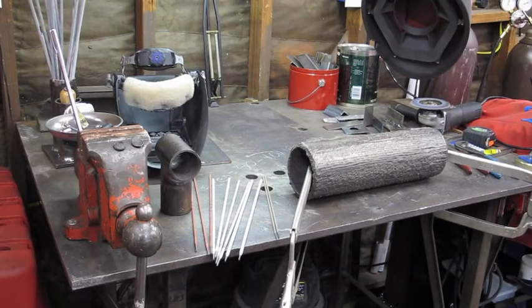Hello YouTube and welcome to Weld Fever. Today we're going to do some stick welding, and I have some different stick electrodes out that we can experiment on. Mainly what I'm going to cover is the difference in how to handle these rods. There are two types of rods that need to be oscillated — those are rods that end in a zero or a one, so the most common are 6010 and 6011. Those two rods need to be oscillated in order to be applied properly.